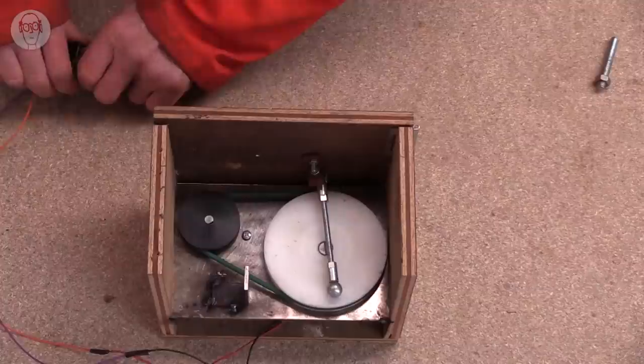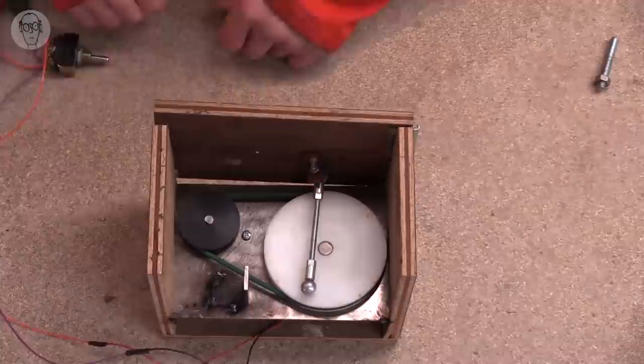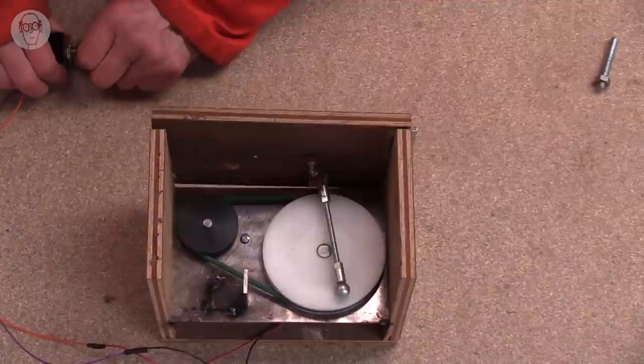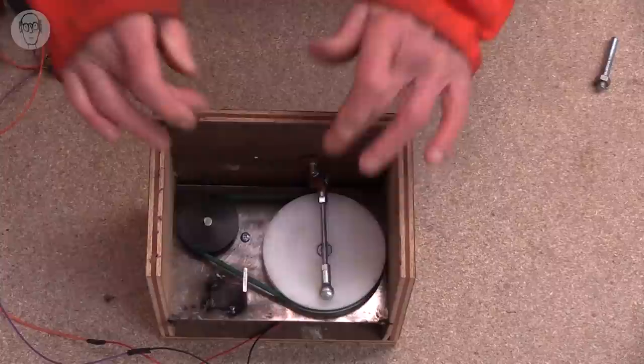One crank I like is what I call a locking crank. So this crank is connected to a door mechanism. And at the moment, I could actually just pull the door open. Of course, in this instance, it's slipping on a belt, so I could have connected it to the motor with gears or with a chain. But that puts a strain on the motor if somebody does pull it open, so it's not ideal. The simplest way to lock it is to get it to stop precisely over the centre of the crank, because then there's no turning force. It doesn't want to turn either way.